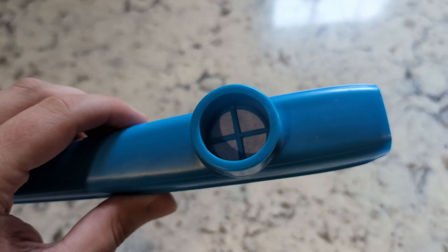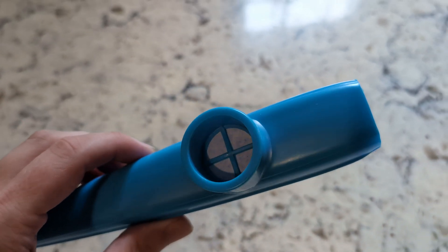The even bigger lie, and what ultimately made this a challenging and interesting build, is that the sound you're hearing is not entirely my voice. The standard kazoo's signature buzzy sound comes from a small piece of paper or plastic embedded within the little port at the top. When you hum into the kazoo, the vibrations cause the paper to flap around and that adds harmonics to the sound — that's the buzzing you hear. My initial thinking was that I could put a little microphone inside the kazoo, run the sound through autotune, and pipe it back out through a tiny speaker also inside.